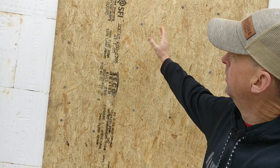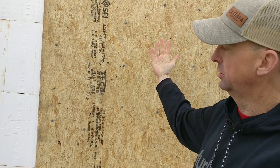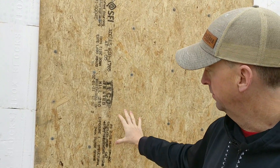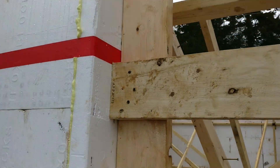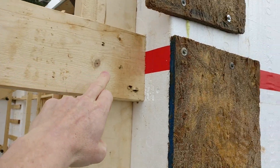Here's a big piece right here because there's a T-wall — the wall comes in on that — so they make sure it doesn't push out and separate, with extra bracing there. The nice thing is all this comes off once it sets up. You can see all the openings have the caps on them, and then they have bracing that goes in between them.